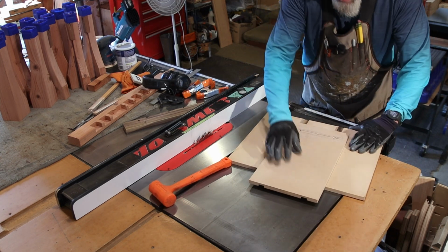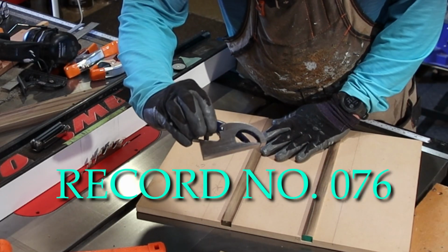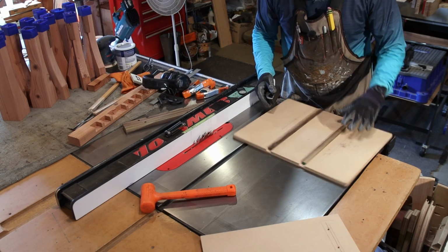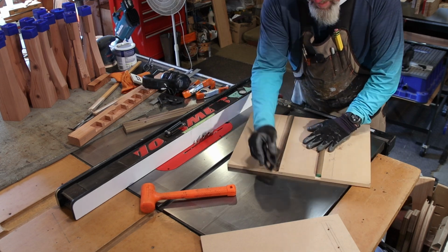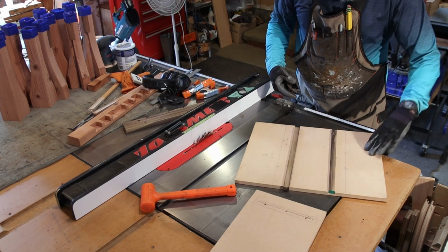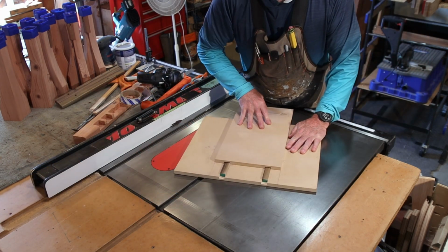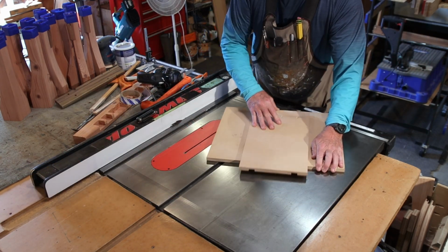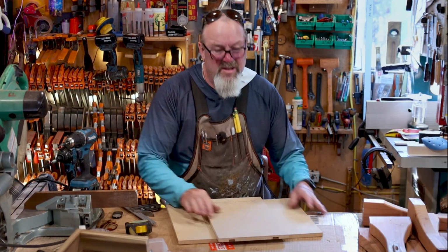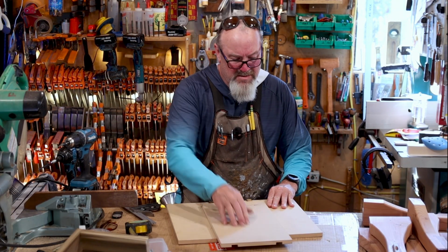We can actually wax it probably. I have my little block plane that I've had since I was a kid, number 76. Flip it over and do a little bit on this side. Sometimes putting a little bevel on there helps. All right, there it is. It's still pretty stiff. With a little wax on there, you gotta wax your tools, you're gonna wax this stuff too. So we got this in and it slides, look at that.